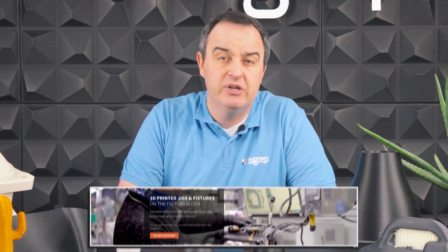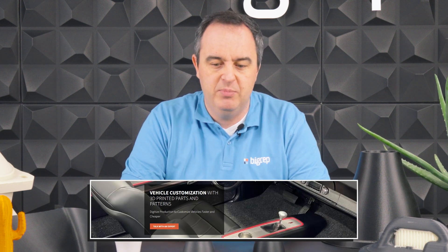Let's talk about some applications for carbon filled filaments. A common application we've seen is manufacturing aids — jigs and fixtures. The ability to make a part to hold your part when you're milling means you want it to stay stiff; you don't want drilling, cutting, or polishing to cause that fixture to change shape. Having large format parts less prone to warpage enables very quick turnarounds for custom, low-quantity applications. The improved surface quality and stiffness of carbon fiber really opens up the space in automotive, aerospace, and drones — and we're seeing more and more every day.